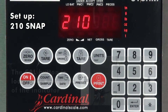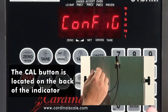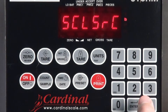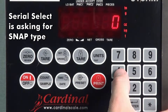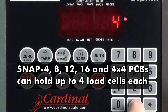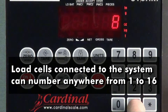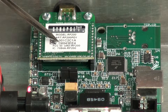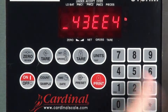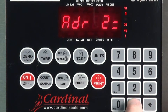To set up the Snap 8, press the CAL button until the AD prompt appears on screen and then press Enter. Several variables may be modified based on your system's requirements. The serial select prompt asks what kind of Snap system you are using — enter 4 for Snap 4. This refers to the capacity of the PCBs, as the cards for the Snap 4, 8, 12, 16, and 4x4 can hold 4 load cells each. The cells field requests the number of load cells connected to the system, which can number anywhere from 1 to 16. The Address 1 field requests the address of the radio for the Snap 8 with the jumpers in the Scale 1 position. The indicator will divide the number of load cells by 4 and ask for that many addresses — so 12 load cells will have 3 addresses. The address inside the RF box needs to be entered at both prompts.